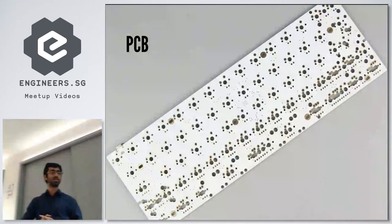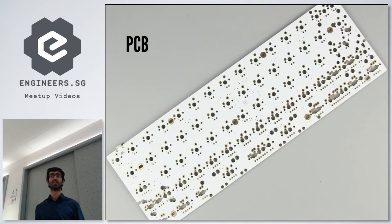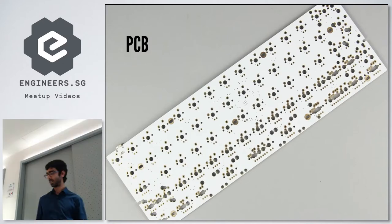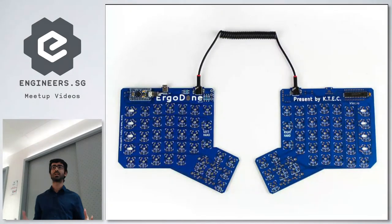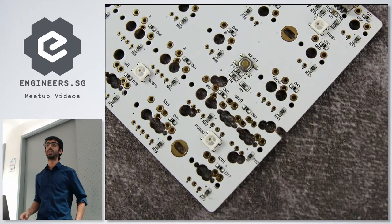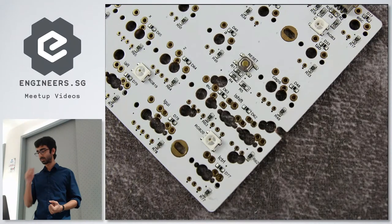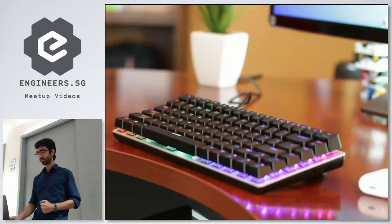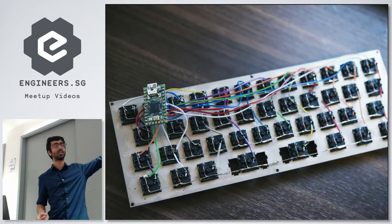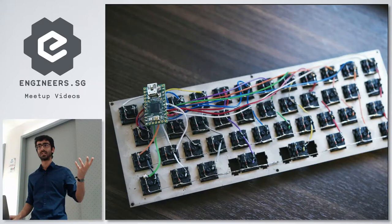The PCB is the heart of the keyboard. It influences the layout, customizability, whether you can program it, and the main features — like is it a split keyboard, does it have LEDs, does it support extra LEDs per key, does it support programming? Some PCBs come built-in with LEDs; this is an example of a PCB with LEDs added on. Or you can forego the entire PCB and hand-wire all the switches to each other. If you do that, you need to buy a small microcontroller which is the USB interface and manages all the key presses — that's the more DIY option.